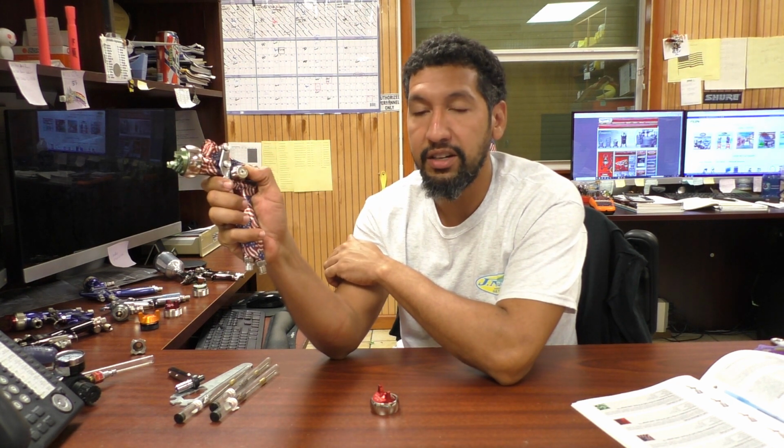Just to touch on something, I'm going to hold it kind of sideways so you guys can see in the video. Obviously, I've got my air control, my fan control, and my material control here. Another thing I liked is here. While I'm on the trigger, I can adjust my fan control really easily. When I'm off my trigger, I can still adjust my fan control really easily, all with one hand. I liked that I was able to do that.